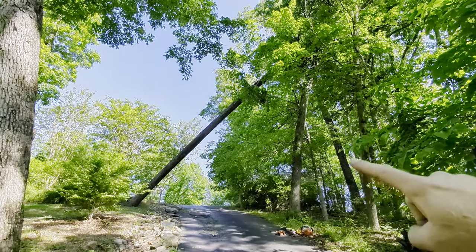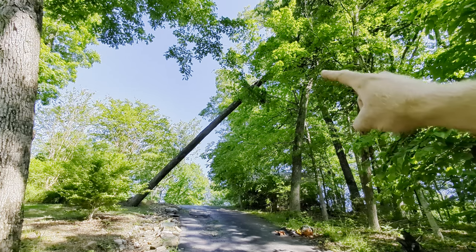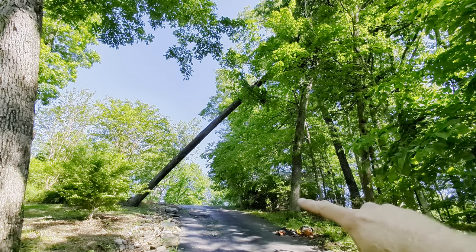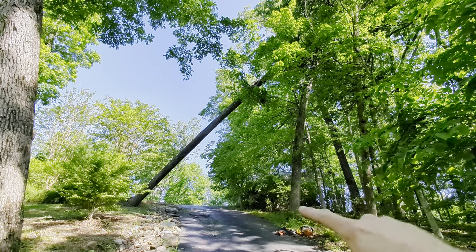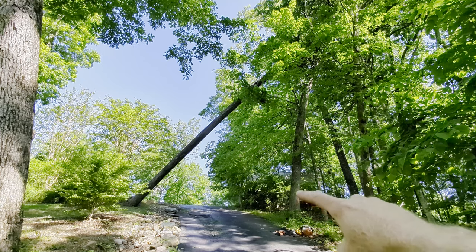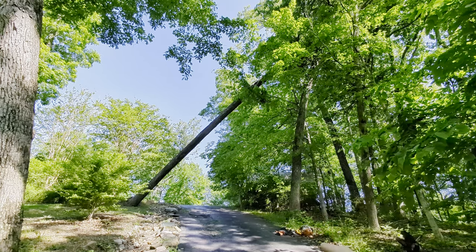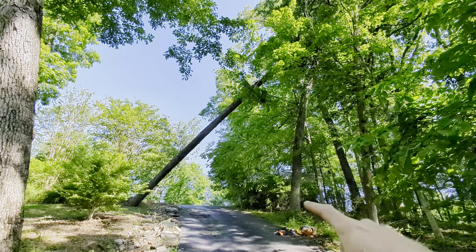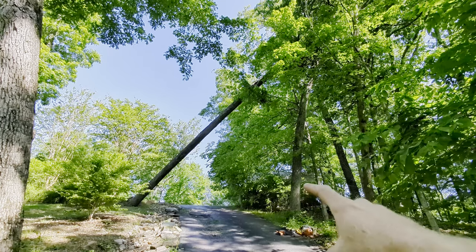If you see right in here in this region of this hickory, we've got a lot of pressure built up right there. Now I'm gonna come in, I'm gonna cut at a more comfortable height, a little above my waist. I don't wanna be down at the ground, because down at the ground, when I need to run, I have to stand up first. I'm gonna cut about waist high, that way as I cut, if that thing starts to go, I can get out of there. But anyway, let me get off of here. Well, I'll shoot some footage of wrapping the chain, because that chain weighs, it's outrageous.